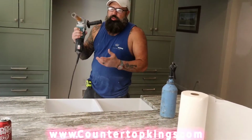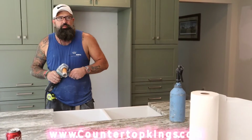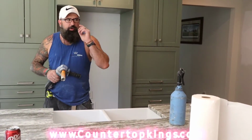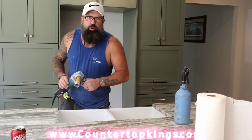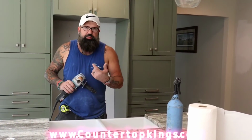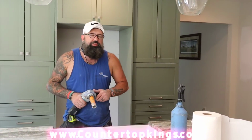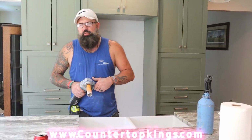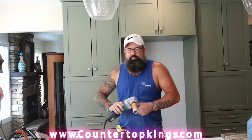A lot of amps when we run the faucet hole bit and the vacuum, so we're just going to turn the vacuum off, plus David's polishing. It doesn't make a lot of dust, plus I'll use water. But pay attention, when I drill these faucet holes, I always start at an angle. Last thing you want to do is skip your faucet hole bit across a daggone slab size island and mess it up after you spend all this time and install it.